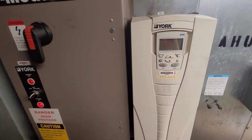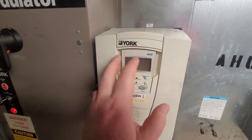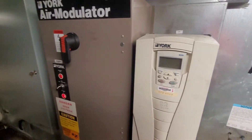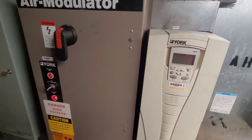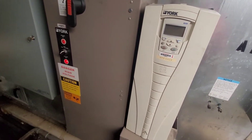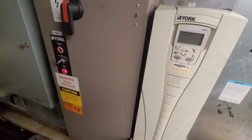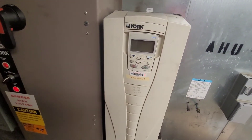This is basically the 550 — I think the specific designation on it is AYK, for those of you familiar with it. Now, this panel is one of the older panels. It is basically only electrically bypassed; it does not have the e-bypass or the Eclipse bypass. Everything is just contactors and stuff like that in here, and this drive has failed.